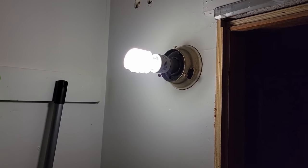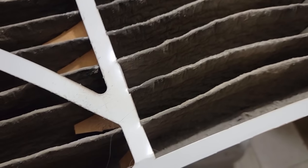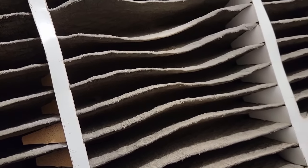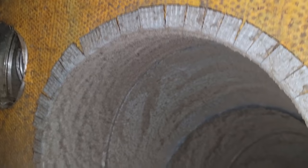See how bright that light is? There's no airflow whatsoever. My guess is this filter was blocking off the airflow so badly that it probably overheated the coil. We need a new filter for sure - we'll leave that out for now. Looking at this return, it's not very big - maybe 14 inches at best. Not a lot of return air.